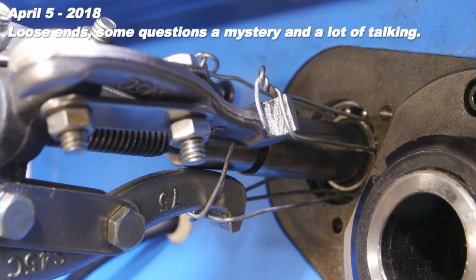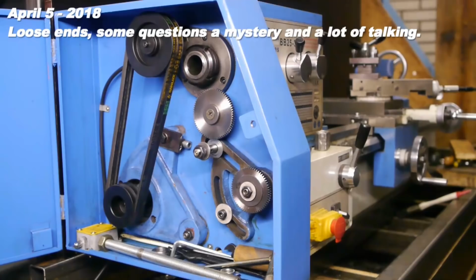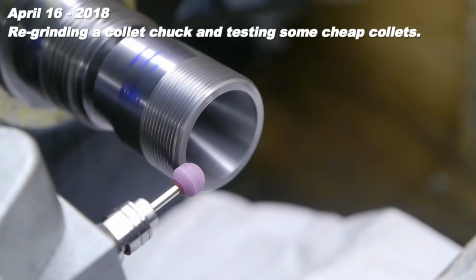Oh, and I tried to pull out the bearing, like someone suggested in the comments, but I couldn't make that work. Too bad, because it could have saved a lot of time. I suspect the bearing broke because there was too much tension on the belt. These small bearings cannot take much of a radial load, and since the pulley is sticking out pretty far, that gives the belt some extra leverage. And there's the compressor kicking in.